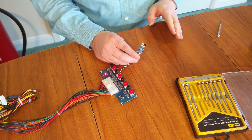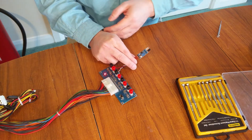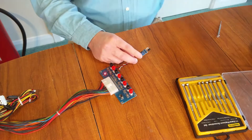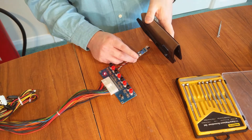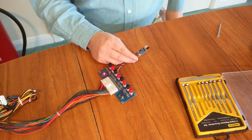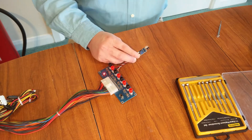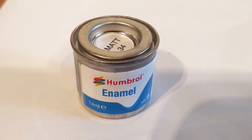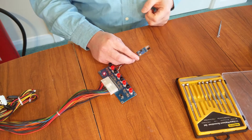I'm pretty sure I can use these devices to detect the underside of trains. The only problem is that the underneath of trains is generally painted black, and black doesn't reflect light very well. If I move my black phone case close, even up close it's still not reflecting. Whereas if I use this white packet, it does detect it. So the worst case scenario is I might have to put a bit of white paint underneath the trains I want to detect. You won't be able to see it when viewing the layout, because you don't normally see the actual underside of the chassis.